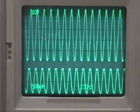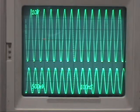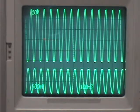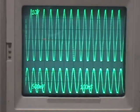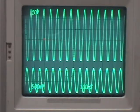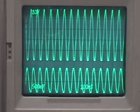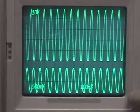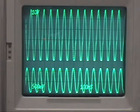Let's go up in frequency now — that was 14.150, going to 60, 70, 80, 90, 200, and continuing up to 14.350. What that looks like is: if I had a drive level of about 1.2 volts, as shown at the bottom, at this point it seems to work fine.